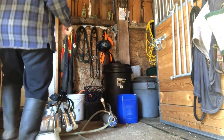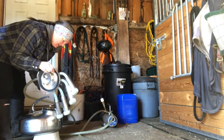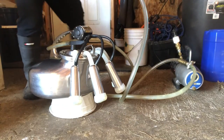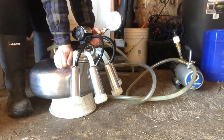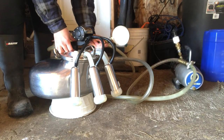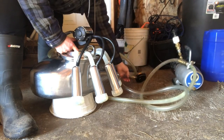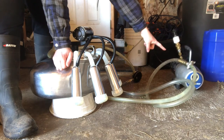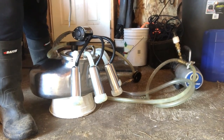Right now I've just gone to wet my hand in that nice clean soapy water, and then I'm just wetting down the little rings — that gives us a much better seal. The next thing is I'm going to turn the pump on. You're going to see the pump rattling and shaking; it has to come fully to temperature and then it'll stop shaking. I'm also pushing down on the ring to make sure that the pressure climbs up. The Surges are funny like that — if you don't push down on the ring and then a little bit on the pulsator, you're not going to get the pressure that you need. Now that the pump has stopped shaking, it will come to the pressure it needs to.